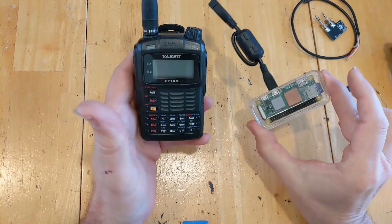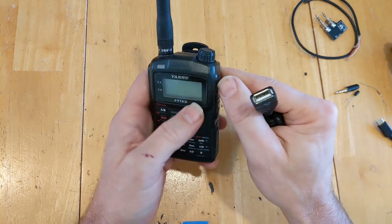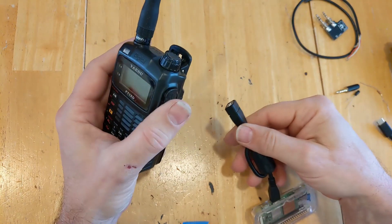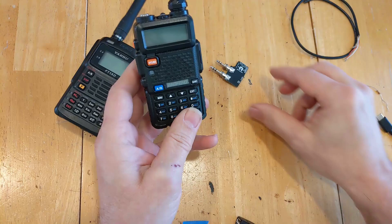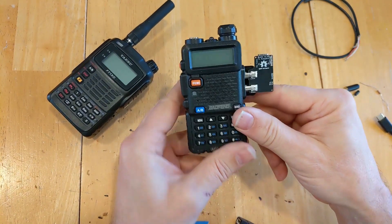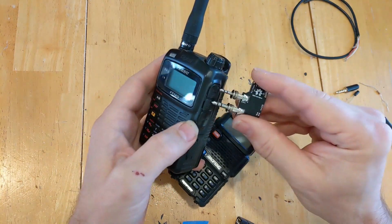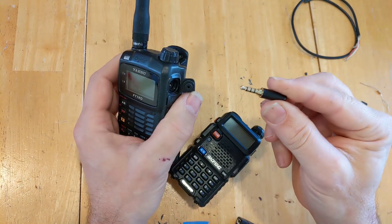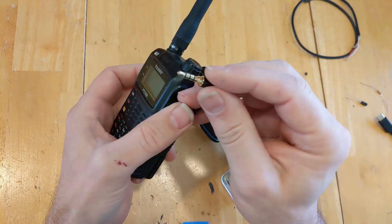The question today is how do we connect a Raspberry Pi or TNC cable up to a Yaesu HT? This could be an FT1, FT2, 3, or 5 — they all use the same speaker mic jack. There's no USB port here like on the more expensive radios, so we can't just plug in a Raspberry Pi with a USB cable. We need some sort of radio adapter. If you have a Baofeng radio, you can use an AIOC device which has cool prongs already set up — plug it in and you've got a USB port on your Baofeng. But your Yaesu FT1, 2, 3, or 5 doesn't have these pins. All we have is a speaker mic jack, a four-prong or TRRS plug.